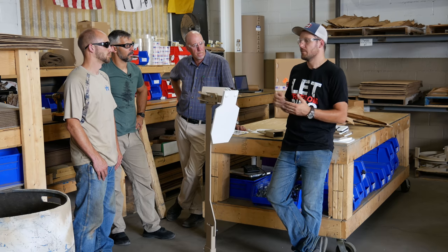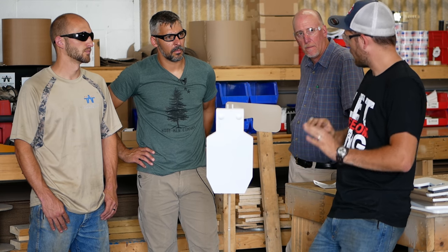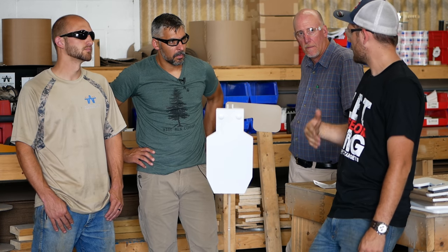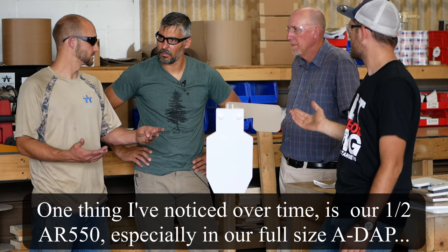It's very, very thin. And so if you're hitting that with 5.56 and you're at close range, it's possible to see little tiny marks, almost like pores. They look like a pencil point. Those are perfectly fine. And the plate that we buy actually work hardens as you use it, so it's going to get stronger and tougher over time. That's cool. So I get questions about that sometimes.